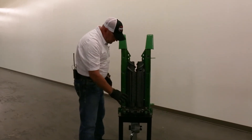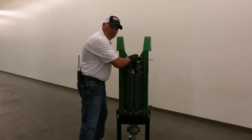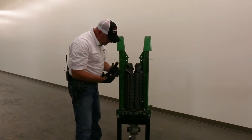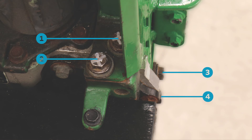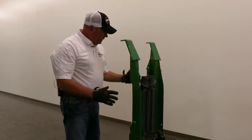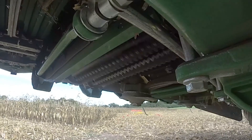What we've essentially done here, once we put those shims in, is we've been able to push this row unit ahead and away from any contact that it might be making on the rows. As far as tightening them, you've got your shim down here — tighten the back one first, tighten this one second, and then come over to your side bolts and tighten those two last. Obviously you're going to do that on both sides. That'll help hold the row unit together and maintain that gap up on the top to make the 360 chain roll move freely.